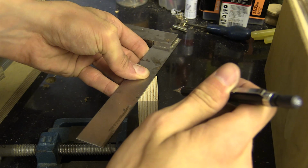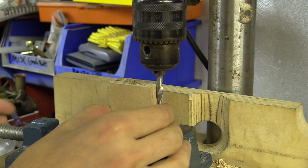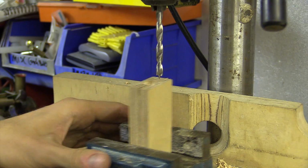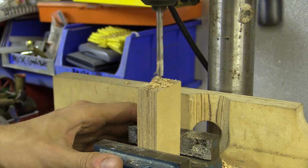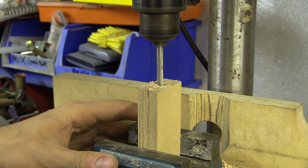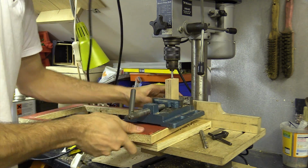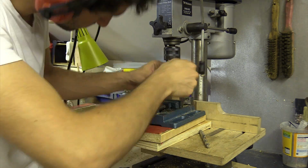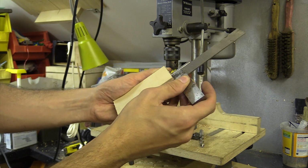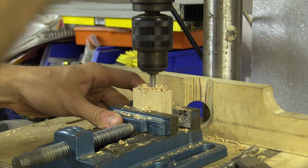After cutting some pieces of ply, I prepared to drill the hole. It took me a few attempts to get right, but using a vise and pushing the material against the drill bit before tightening held the material parallel to the drill bit. I'm making this mechanism from 2 pieces of ply. The shorter piece will hold the tightening bolt, which will be made from a large countersunk machine screw.